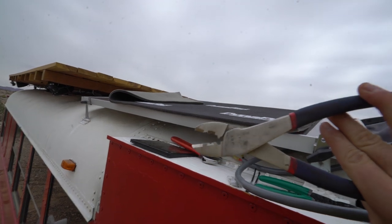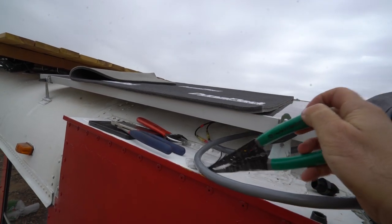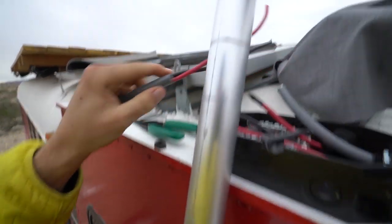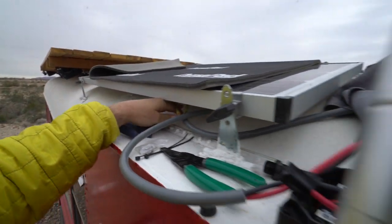Not the little, cheap, chintzy electrical ones — it's just a little bit too hard, in my opinion. So what you do is you connect this end of it. You gotta cut it with a razor blade, just like I did here. Then you gotta strip this off, give it a good old fashioned crimp, and heat shrink it.